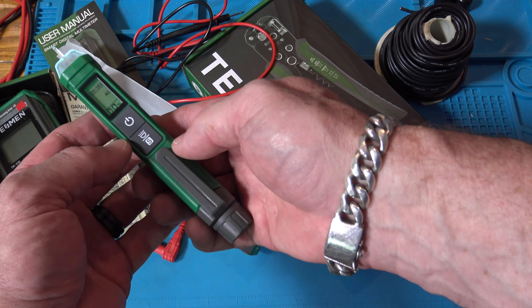There's a little guide here — you push a button and it pops out. If you put a wire in, you can adjust how much you're going to strip off. The teeth come down, grab the insulation, pull the wire, and the cutters go just deep enough to pop it. It looks professional every time, doesn't nick the wires. It also has a little tension adjustment for how much you want to grip the wire.